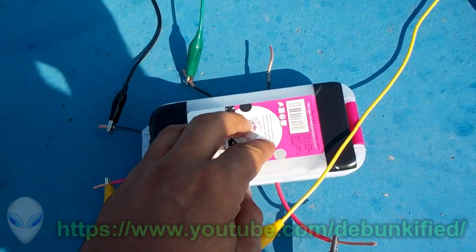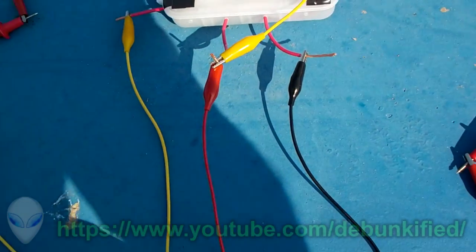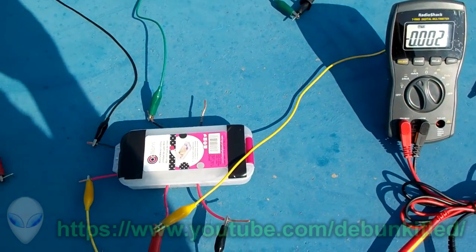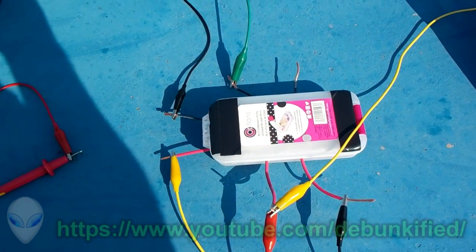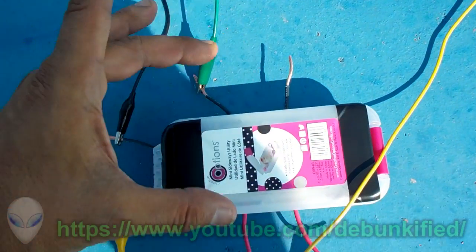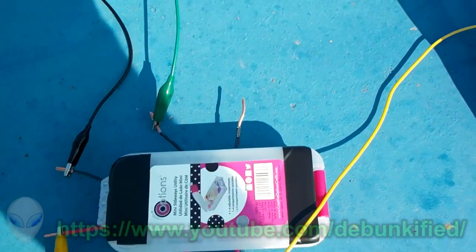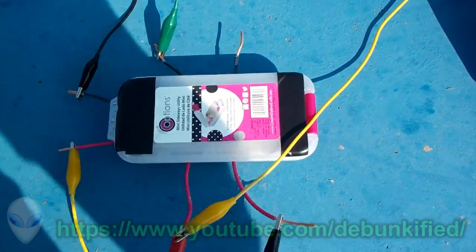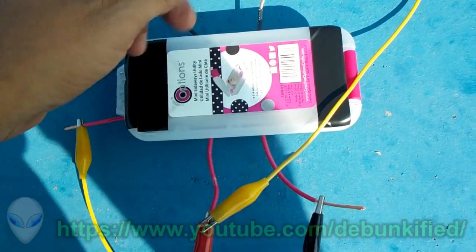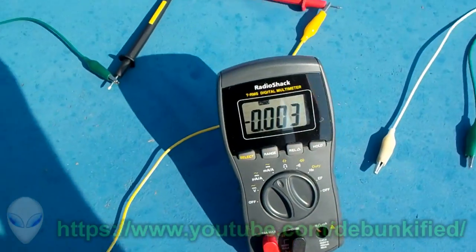There's no way I'm going to be able to show the circuitry because the loads are the circuitry. Now since there are two of them, the only way I was able to show this is by having those two loads in there. So this is the first load — the negative and the positive — and there's the second load — the negative and the positive. They're going to be connected in parallel, meaning negative to negative and positive to positive, with the meter in between the two positives.